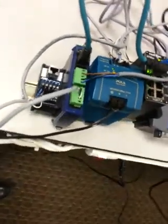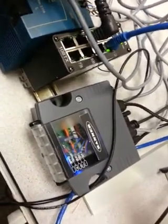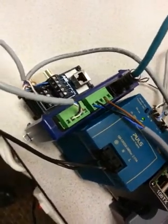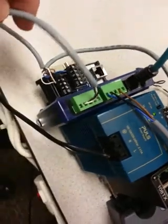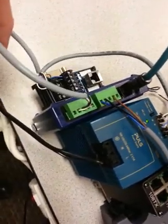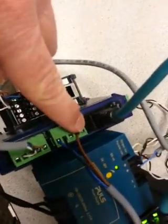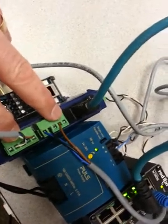Now what I did in this case, this reader actually has a main port and an auxiliary port. The main port is RS-485 configured currently, because the application might be to have it be quite a bit further away than standard RS-232 would allow. And then I took the auxiliary port, which is RS-232, into here. My only reason for doing this was to mimic 2 barcode readers since I only have one.